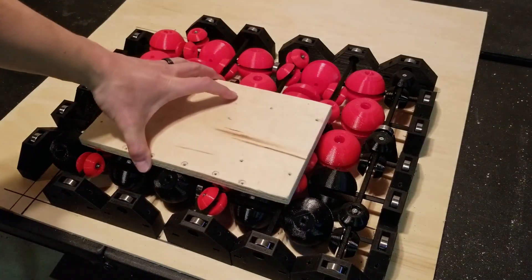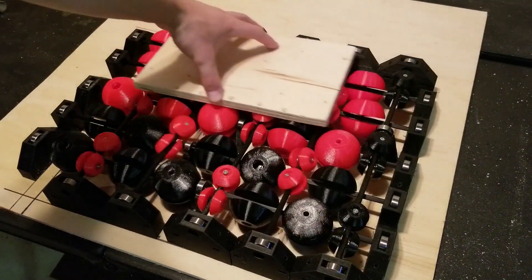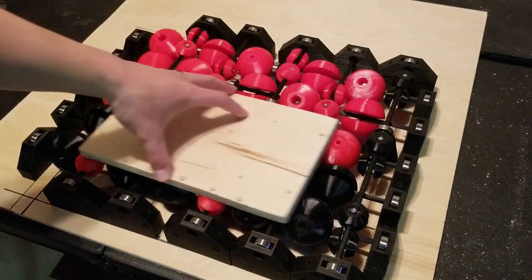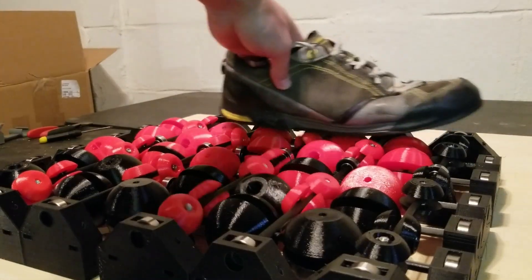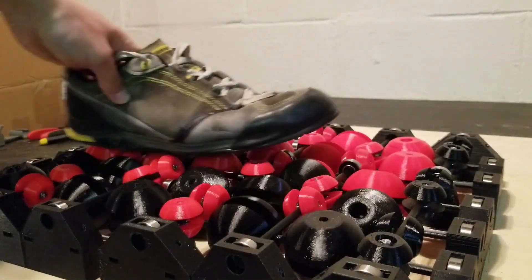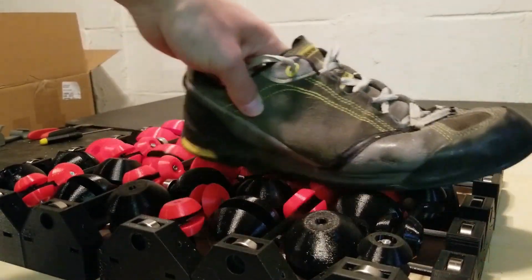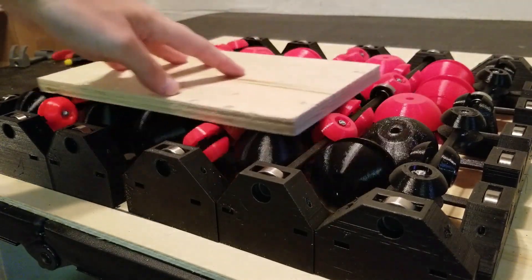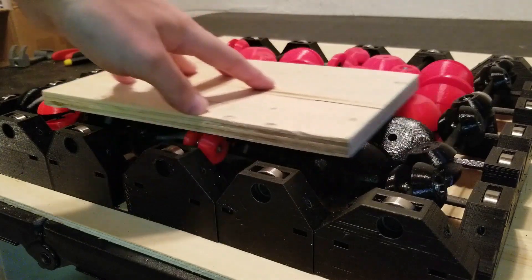I think the large spheres would need to be smaller while somehow making sure that the X and Y rods do not intersect and the tops of all the spheres are running along the same plane. Also, because it's bumpy, it makes noise with each bump, so it ends up being a bit noisy. I think this could work as a conveyor system for large objects, with the spheres being a cheaper alternative to Omni wheels, but for a VR treadmill, I don't think it'll work very well.